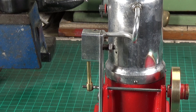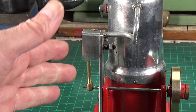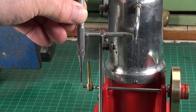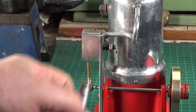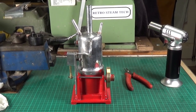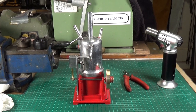I've reamed out the cylinder and polished up the piston, but it made only a little difference and it just didn't want to know. Also the bore is drilled off-centre — instead of being vertical with the engine mount, it's bored at an angle, so the piston is not going up and down parallel with the engine mount, which doesn't help either. So I made a new piston and a new conrod, and it does now appear to be okay. There's water in the boiler — I have actually just run it and it did run.